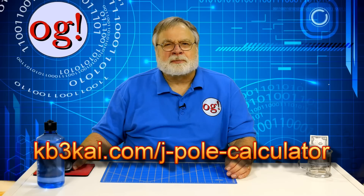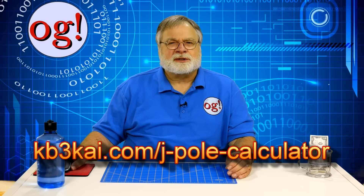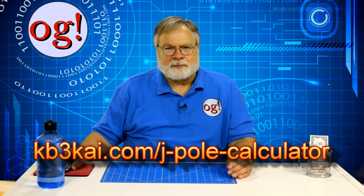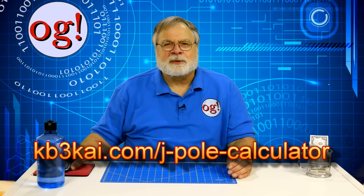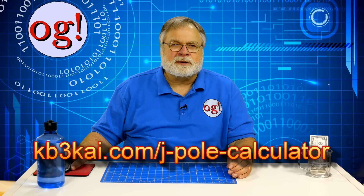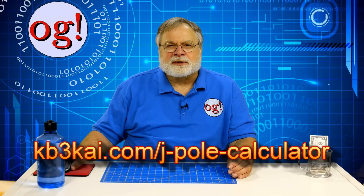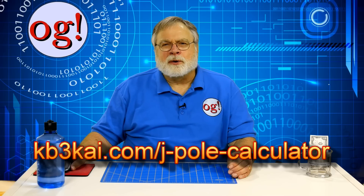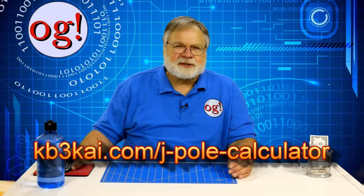So what are the dimensions if you want to make your own J-Pole? You can Google J-Pole dimensions and come up with dozens of drawings, all a little different. David Stansbury, KB3KAI, a fellow Augie, has a cool calculator on his website that will give you the dimensions for any frequency — the URL is shown on the screen. The sweet spot in amateur use for the J-Pole seems to be two meters. 146 MHz is the center of the two meter band and the dimensions are given in feet, inches, meters, or millimeters. Note the drawing carefully to see what exactly the dimensions are, as you'll have to take this into account in your build plan. David's formulas assume a 95% RF propagation velocity factor for both the matching stub and the radiating part, which is a very reasonable assumption.